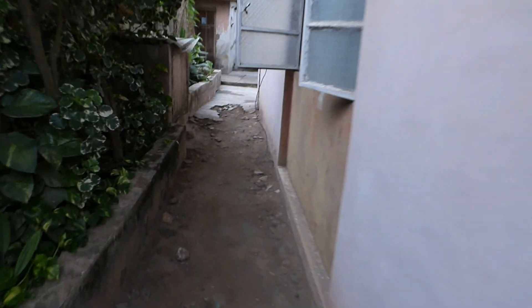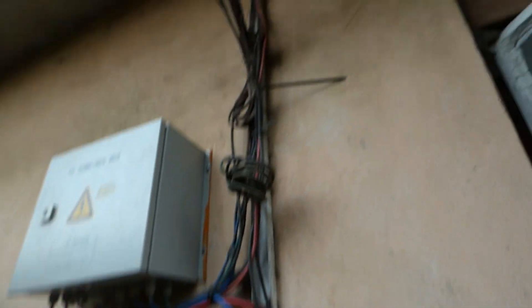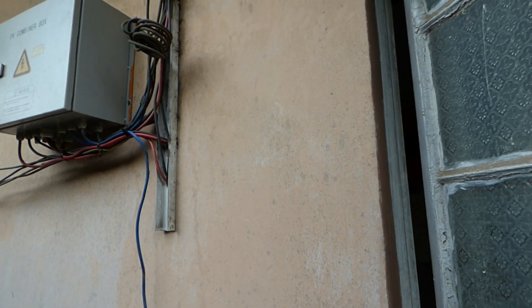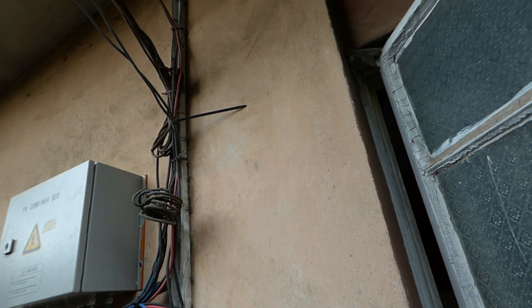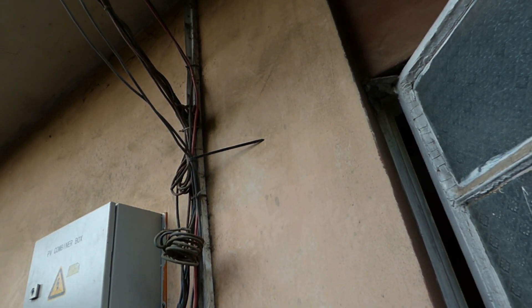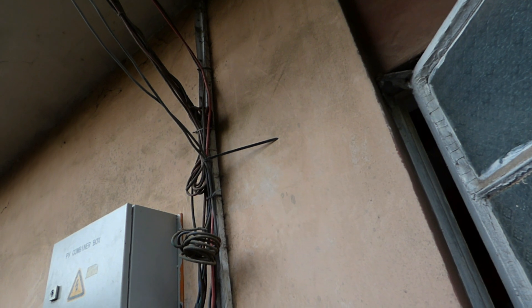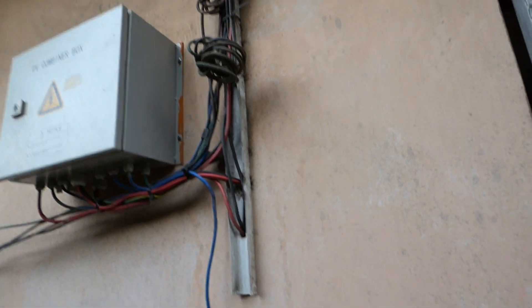While I'm here this time, these are the things I'm going to do. Here is my earth cable — the earth rod is inside and we're going to dig it out and use proper earth cabling. As you can see, we're going to tidy up the cabling a whole lot. The combiner box is no longer inside; it's outside. I'm sending my team for training on how to use and bend pipes — the first installation using pipes will be done here. We have three different sets of panels, which is why there are so many wires. We'll fix that by doing a junction box on the roof so we have fewer wires coming down into the combiner box, giving a neater result.